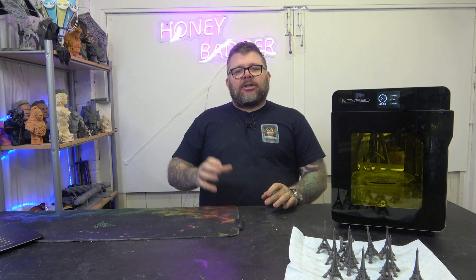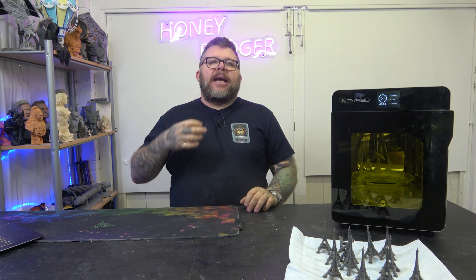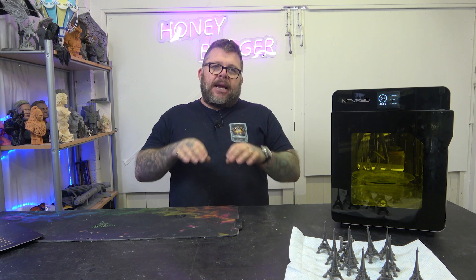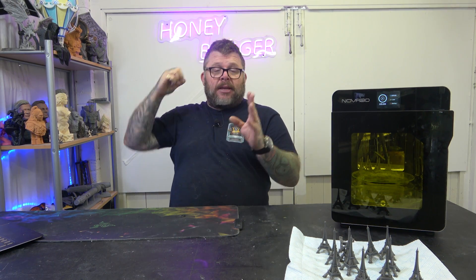The build plate is glass. Because a lot of these curing stations use a plastic build plate — they perforate them with holes. Now, if a model you put in there has still got a bit of IPA on it or there's still a bit of IPA in one of the drain holes, as it's curing, that leaks out and it wedges into those holes, and it is a real problem trying to get them clean. I ended up wrapping them in cling film so I could just lift it off and put a new piece on. But you only need to forget it once and it's a problem.